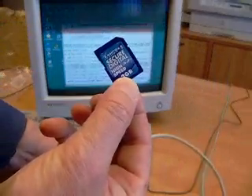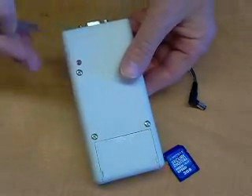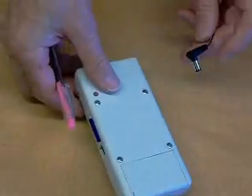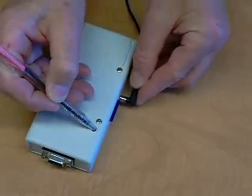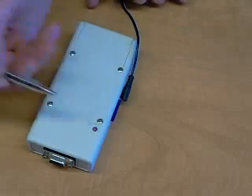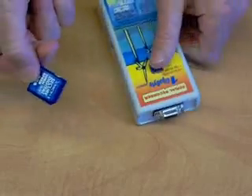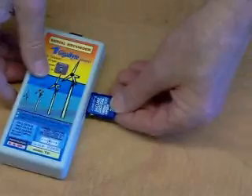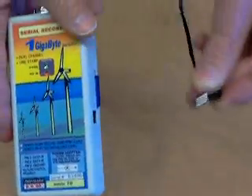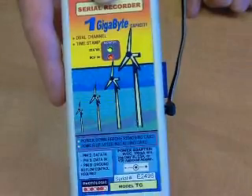Change the settings of the recorder by making a config.txt file on the card, then you can edit it on a PC. Insert the card, push the red button while powering up, and wait for the beeps to stop. Read the card on a PC using Notepad, edit the list of settings including the clock calendar, and return the card back to the recorder. Power up and wait for the beeps to stop. Now you're in record mode, waiting for data.